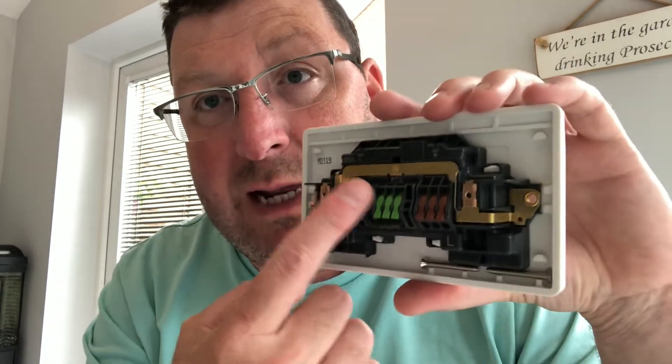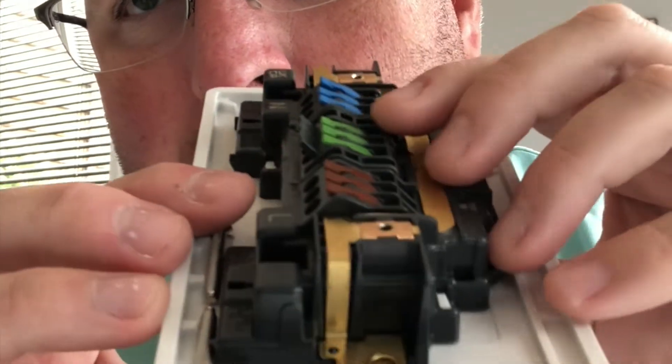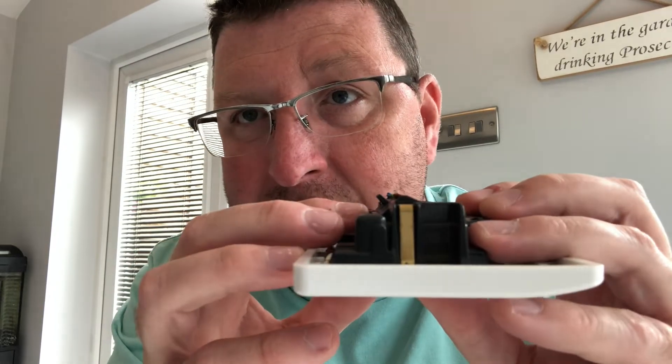Be careful about the box you're going to be using — it's going to make a massive difference to overall quality. If you're not careful you could end up crushing some of the cables, as this little bit here does tend to stick out. Unlike other countries, in this country we have to use sleeving, and I think the design is there to allow for that so conductors aren't showing outside the termination. I also like that this is double pole with a positive and firm connection on the rocker.